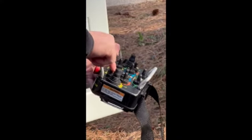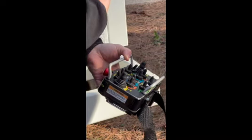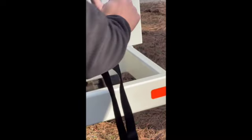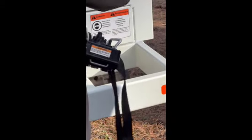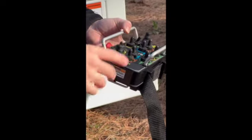When you're in track speed high, what you guys are going to find is this machine will not turn. It's going to deadhead for about 1 second. It'll kind of give you a little bit, then it's going to sit there and stall out. A lot of guys think that's a problem. That's how these Cat undercarriages are designed. If that happens, just turn it out of high gear. The machine's going to turn no problem for you.